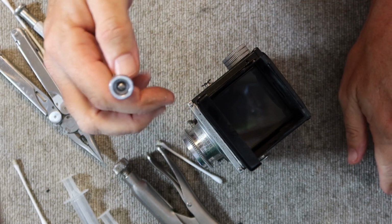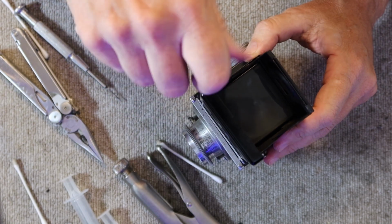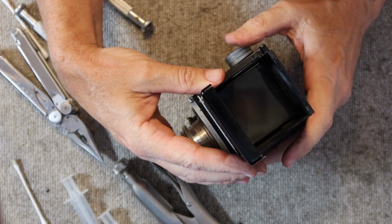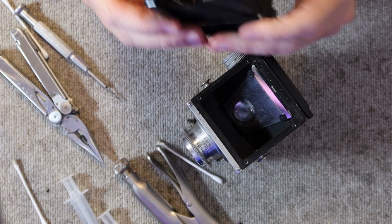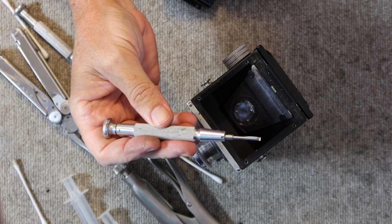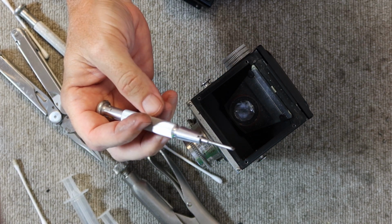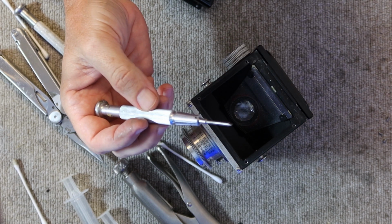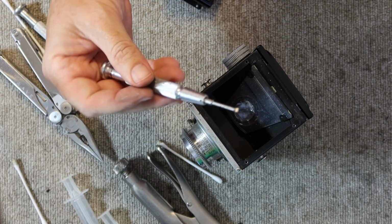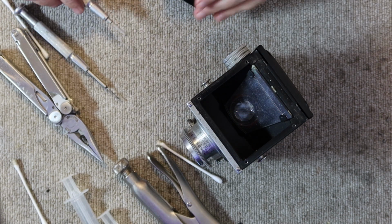The tool I'm using is what they call a JIS, or Japan Industry Standard, screwdriver, which ironically is not made in Japan. It's made in Switzerland, but Japan loves anything made in Germany or Switzerland or places like that. This one goes for about five times the price of a Japanese-made JIS screwdriver. I like them because when they're new, they work really well, but unfortunately they don't stay new for very long. The Japanese ones are actually more reliable despite costing much less, but the Swiss ones have a bigger barrel, so I get more leverage. I guess Swiss people have bigger hands or something like that.